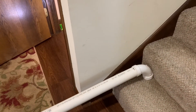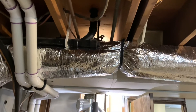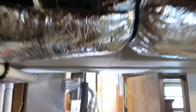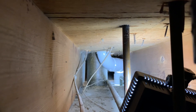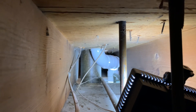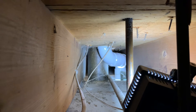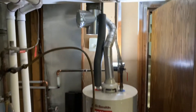So that allowed me to get my measurement. Then I took my pipe and fittings apart, and I glued this to my 50 inch piece. Once I had that done, I was able to come back in the mechanical room and get that pipe into position. So I was able to fish it through this bay. You see the B vent there on the left side of that bay — I was able to fish that two inch pipe over. You'll see the pipe in the top right of that bay; that's where we go up and turn and go up through the chase. That allowed me to get up through there and then glue everything together.